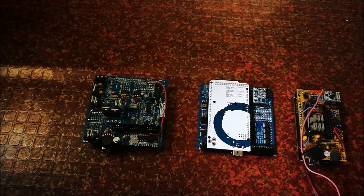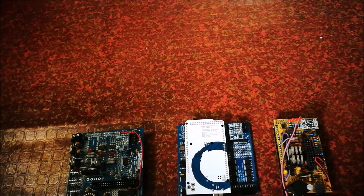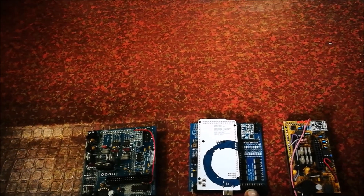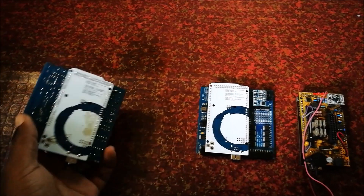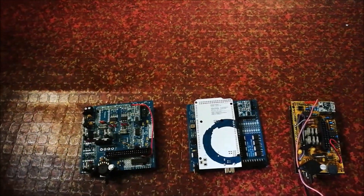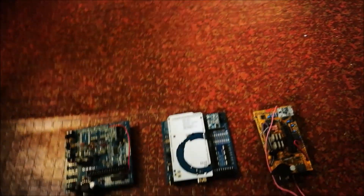The jumpers on the v0.4 are right here, used to set your sensor configuration — same for the UA4C and NO2C. Pin count: the v0.4 has 40 pins; the UA4C has a 24 and a 22, which would be 46 pins; the NO2C has 24. Regarding Arduino placement: on the v0.4 the Arduino is on the board itself; on the UA4C the Arduino goes on the top side of the board; on the NO2C the Arduino is also underneath.